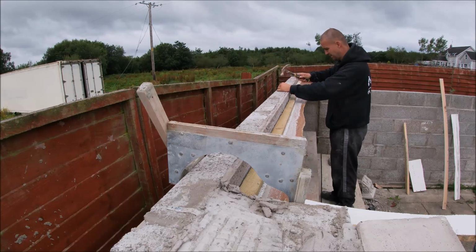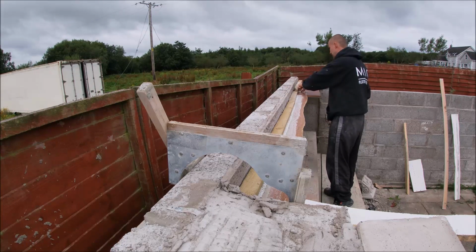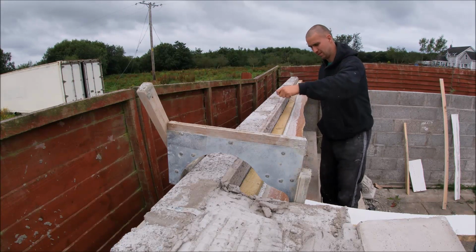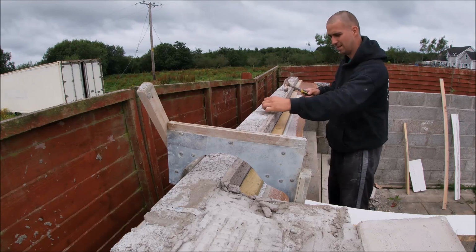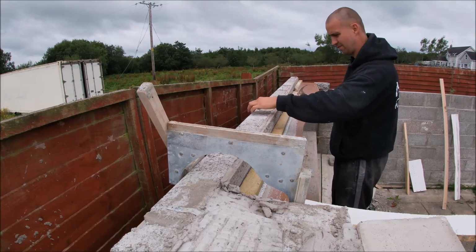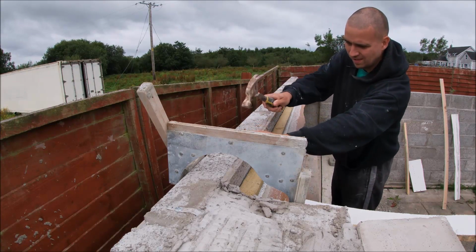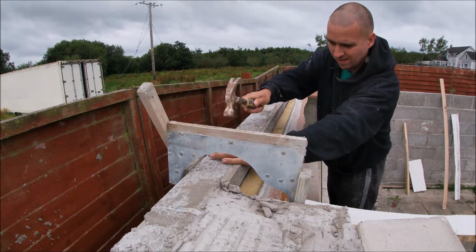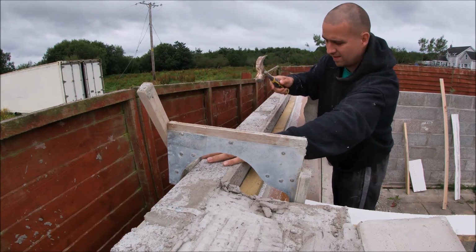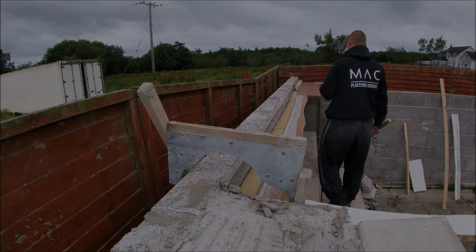What you can see me doing here is putting some nails in, and what they'll do is they'll help grip the concrete, so when I'm pulling it won't just all slide up or slump, and hopefully give a bit of a mechanical key as well. Using stainless steel nails, although if they rust, I'm not too bothered, as this is as much of an experiment for myself to see the outcome and how strong my render itself can be in my mixes. I was tempted to use wire mesh as well, but I didn't really think it would add much more strength than the concrete I was going to use.